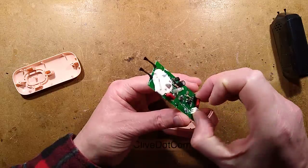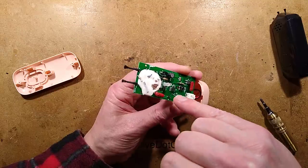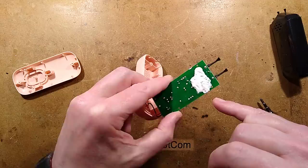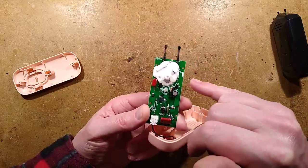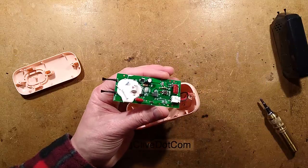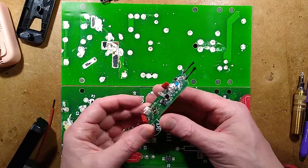So this circuit board has what looks like a microcontroller and a power supply. And then a tiny little transformer here, and I can see what looks like a high voltage diode and a capacitor, but they're all covered in silicone schmoo leading up to these electrodes here. So I'm going to take a picture of this and then reverse engineer it, and we can take a look at the schematic. So one moment, please, while I do that. It has been de-schmooed. So let's explore.